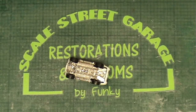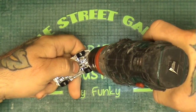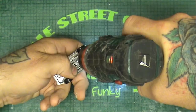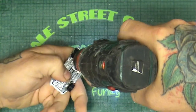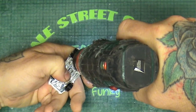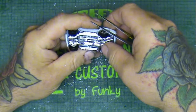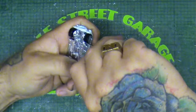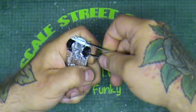Wheels have got to go, the screen comes off. Got to alter the seating, replace the roll bar. First of all, just got to take it apart, just drill out the rivet posts. It's a 1.5mm drill. It's having 2mm button head self-tapping screws later to hold it together. So once they're drilled out, I used a larger drill bit just to take the flange off the top of the rivet post, and it's just a case of popping it open.